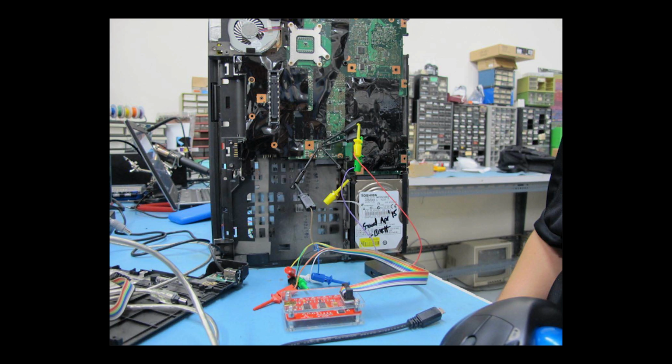So topology-wise, in terms of what the bus looks like now, there are slaves and masters. I2C is a multi-master bus as well as a multi-slave bus, so it's okay to have the Bus Pirate hooked up like this. It's going to act as a master, talking to the slave EEPROM. The computer also has some master in there that's talking to the EEPROM, but they're able to not step on each other. I don't know exactly how that works, but apparently it's okay to do that.